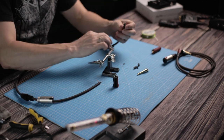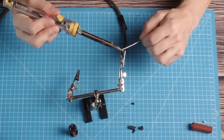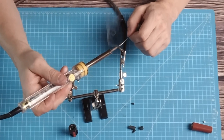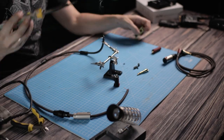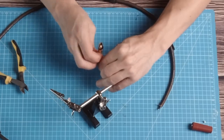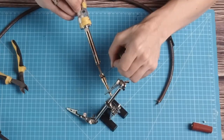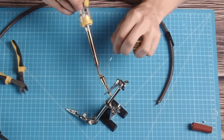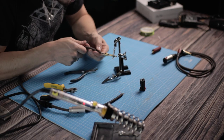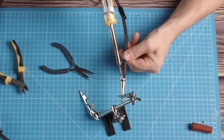You don't need to use a clamp device like I do — it works fine without it, but it's helpful to keep all the parts in position and solder more comfortably. I put some solder on the twisted wires first so it's a bit easier to get a good connection to the plug later. After that, cut down the wires to the length you'll need. Then take the plug, apply some solder on the spots where you'll connect the wires, and bend the wires to shape with pliers so they fit into the positions needed. Now just melt the pre-applied solder and the wires are solidly connected.